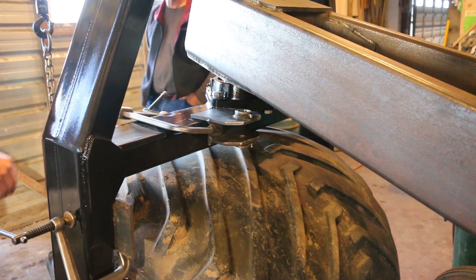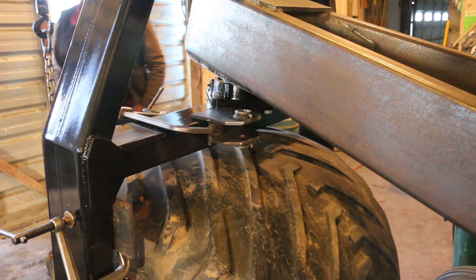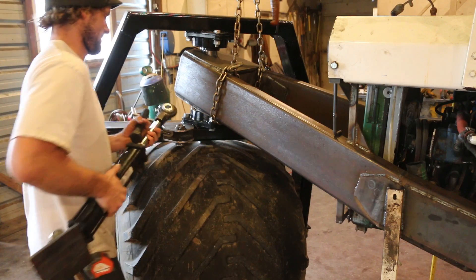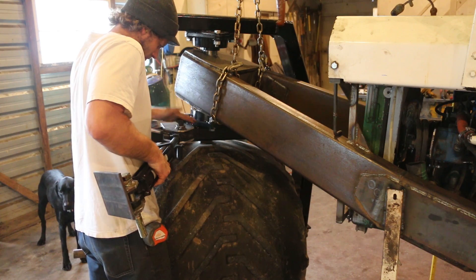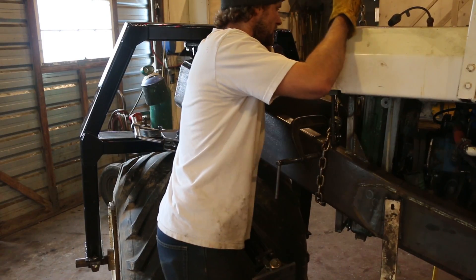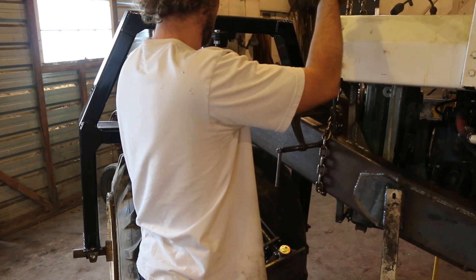I felt like SketchUp was giving me a starting point but it was definitely going to take some dialing in to get the exact right position. I got the back bracket built as well — it's a tight fit getting the bolt in there; it bowed outward a little bit when I welded it but it still worked pretty good. I brought it over and hooked it up to the front bracket and was really happy with the fit — there was very little play in both of them and I was already excited about this improvement over the old front end.